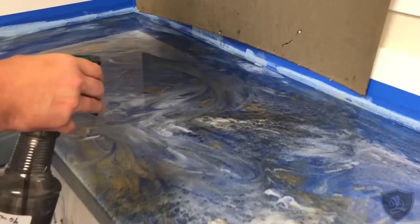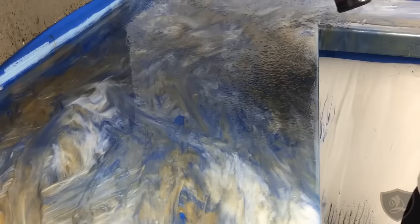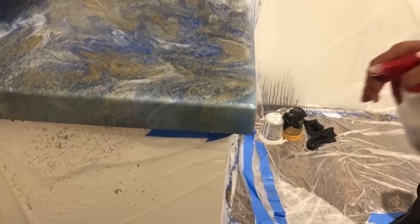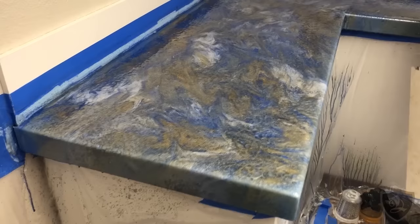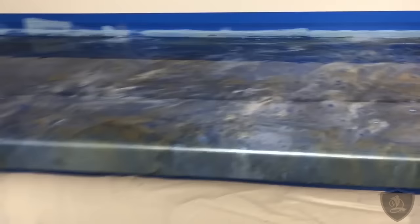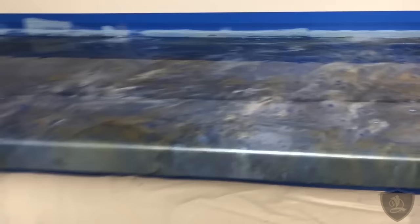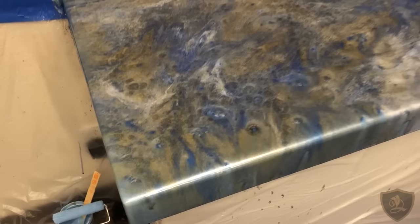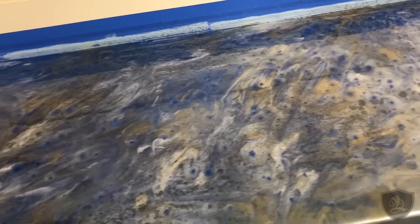The white will hit everywhere. Make sure I hit my faces. Now I'm going to take my white — this is our snow white — going to do the same thing and kind of spritz it all. Beautiful. So after you guys spray the dispersing effects, if the epoxy is too thin in spots, it can fisheye. That's fine — it's not an issue. All you got to do is just pat it in. It's because it's a thin spot, it's breaking the plane of the surface. It's really simple, so if you have those, just get your gloves on and go through and pat the holes in. Can you tell where these bubbles were? You can't — there's so much going on in this counter, it just looks phenomenal.